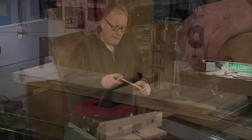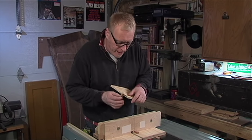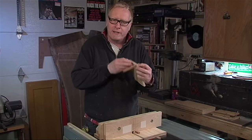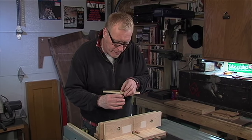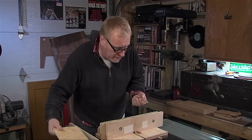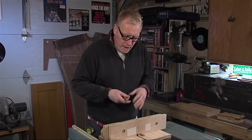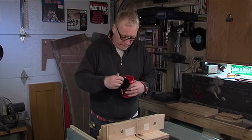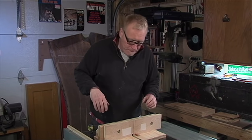I had an extra indexing pin from when I made my original jig — this is the cutoff, so I'm just going to use it as a reference. It's a little proud, but that's perfect — these will just protrude a little bit and I can sand them off or leave it. That'll be a nice fit. If you're making a toolbox with quarter-inch pins or fingers, make a collection of these test pieces. I have a bunch of them and I just keep them in a coffee can — that way you don't have to make them again.